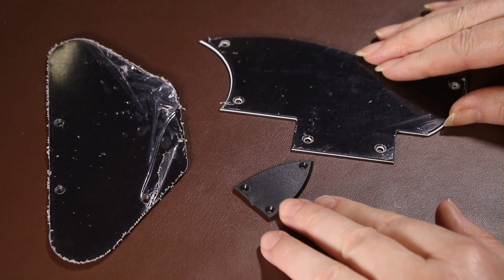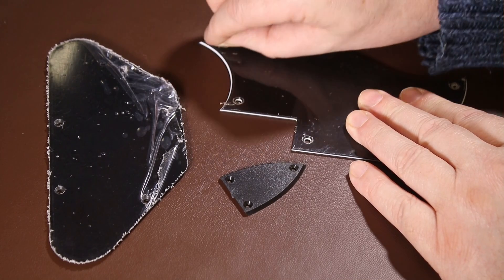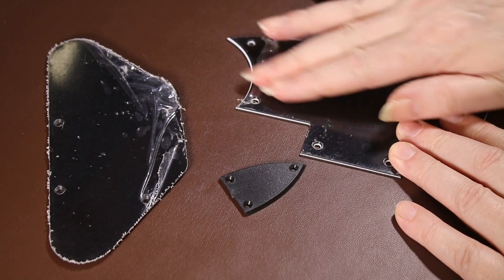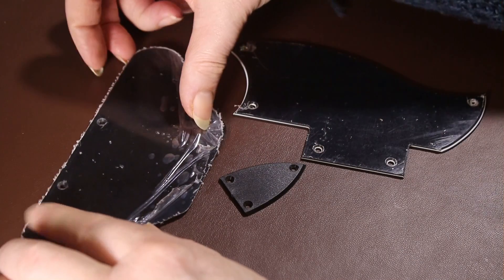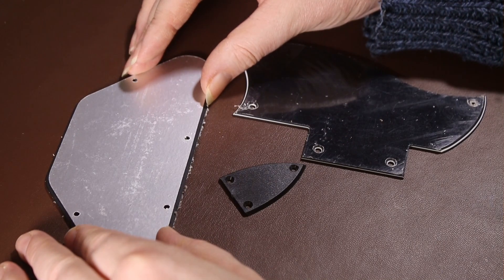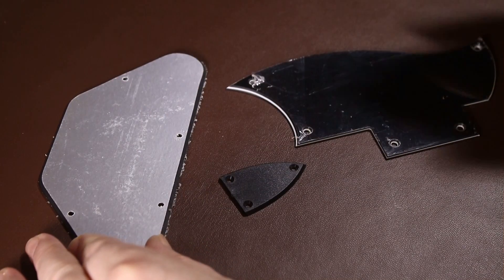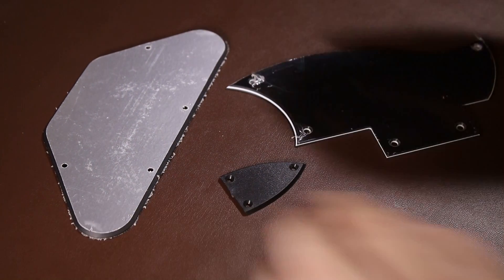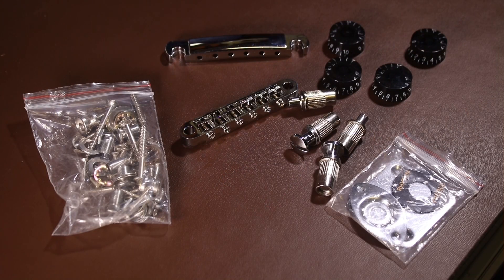The plastic components seem pretty good and pretty standard — they're covered in sticky-back plastic protecting the shiny surface, so leave that on until you've finished putting the guitar together. A really nice touch is that they've put screening material on the back plate. This is important because it keeps external interference out of your guitar, so you won't get as much mains hum, background noise, or mobile phone interference whether recording or playing loud.